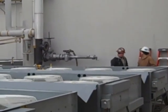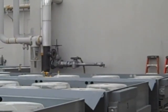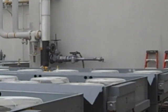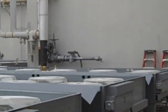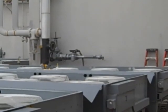They've got the drill rig mounted on the gate valve, and they will use that to penetrate the existing water line. Then they'll valve that off, remove the drill rig, and put the line stop apparatus on the valve.